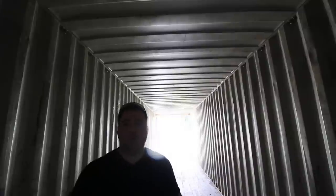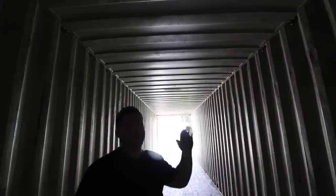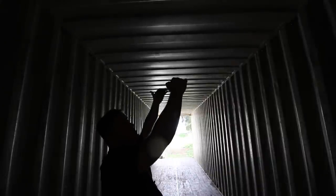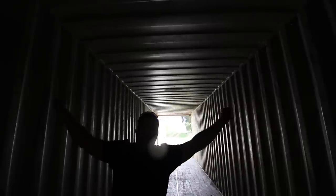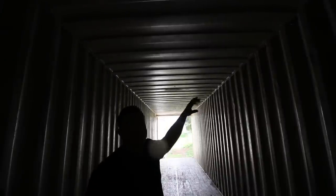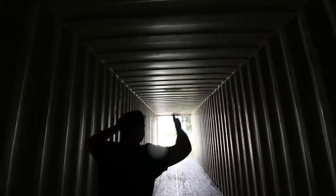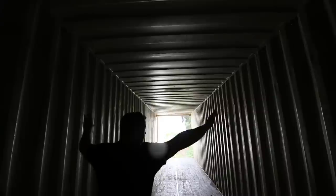In the top two corners towards the back of the container, there are these big chunks of metal that are three inches down. My 2-by-6 is going to go tight to the ceiling — I'll cut one that runs inside there and then my ceiling joists will run across. They'll be concealed within the framing once I'm done. One thing I'm concerned about is the ceiling bow. It does have a good bow, and I don't want it going flat — so I'm thinking I'll put some 2-bys on top of the joists to keep that ceiling up without pushing out the sides.